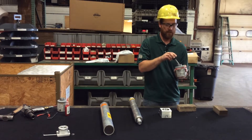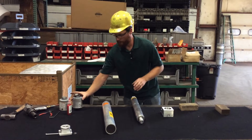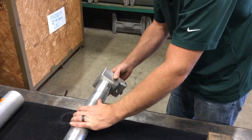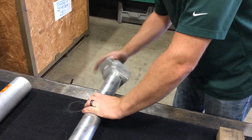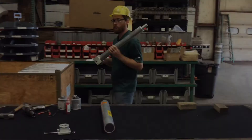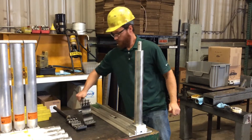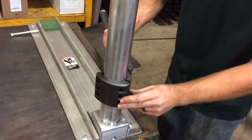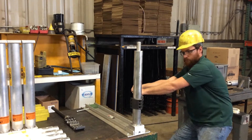Next, we have a silver grade anti-seize that you will apply to the threads of the cylinder pad. Then you'll take the cylinder pad and thread it onto your barrel. At this point, we're going to move over to a table with a rail clamped to it. Pin your cylinder into the rail. You'll have a barrel wrench built specifically for tightening this barrel — wrap it around the barrel, lock it in place, and give it one firm pull to tighten your barrel down to the pad.